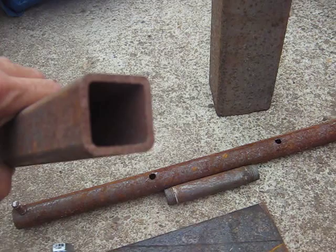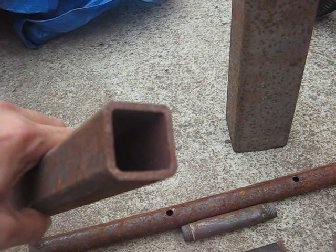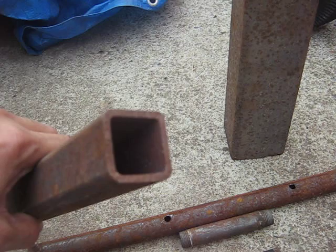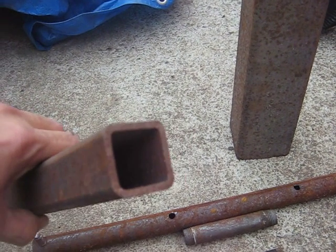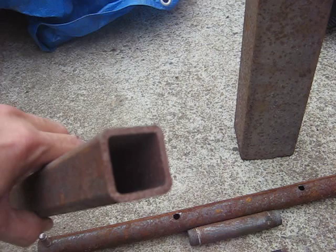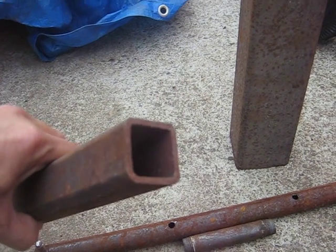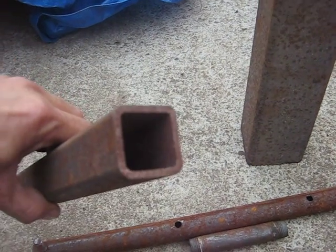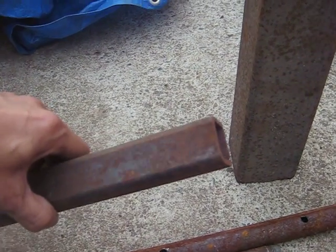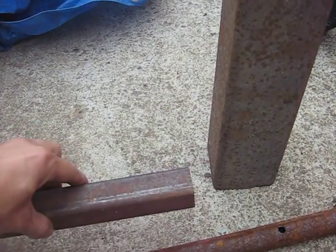The go-kart we built used one-inch square HSS steel tube — it's square with a 1/8-inch thick wall. This stuff here is slightly larger but looks very similar. The only piece of the other stuff I had was about 8 feet long, so that was a little hard for the video. But anyways, that's what I would recommend — it seemed to work out well.